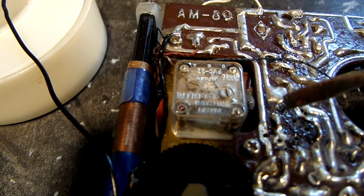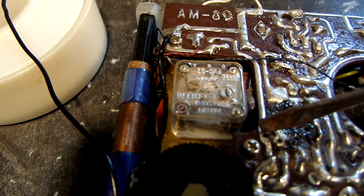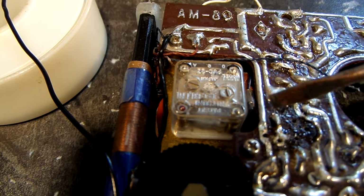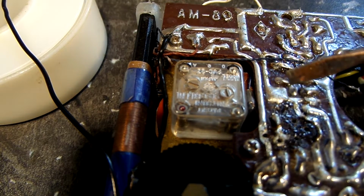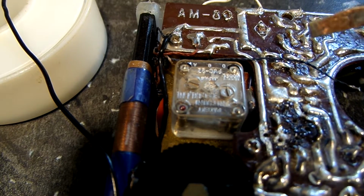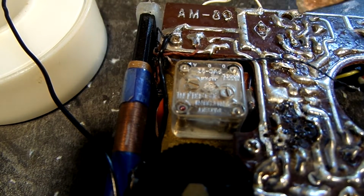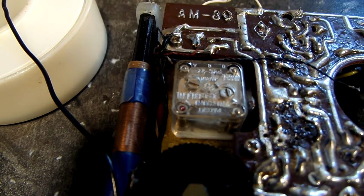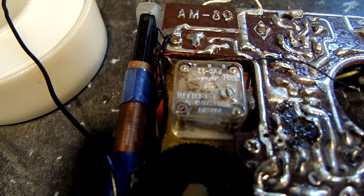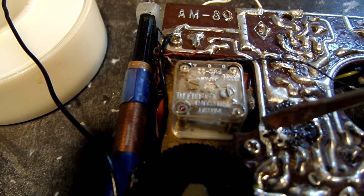There's one leg. That is the leg that connects to the emitter, and there's the other one right there. Now I had measured between here and got that 1570 or 1470 before, but didn't realize that was where it's connected, because I didn't know the resistor was a strange looking beast that it was, and I kept looking for the other lead on the other end of the resistor. So that is the problem with that.